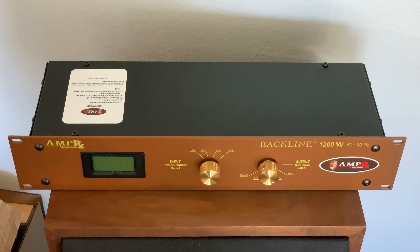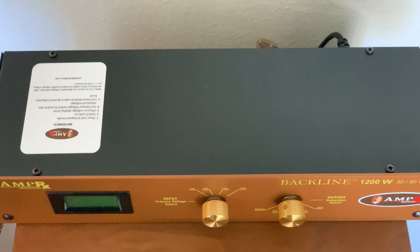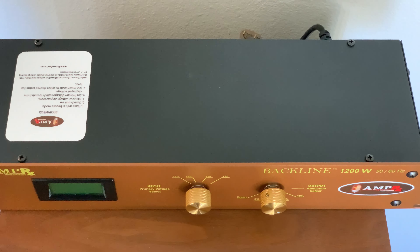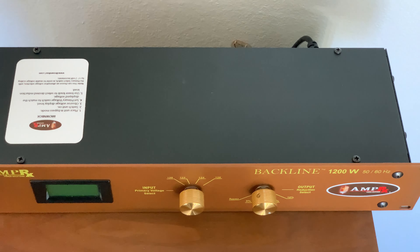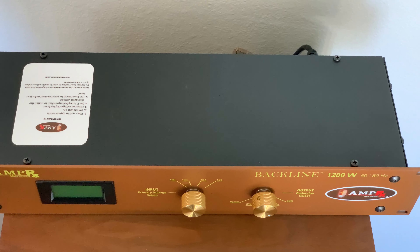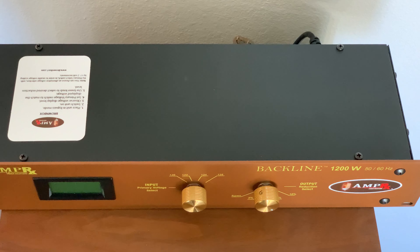The knobs are metal, it's rack mount, and it has a nice paint job and lettering. But it's kind of lazy work. It's probably built by one person who drilled the holes in the paneling and never cleaned up. It looks like it was already painted and then the holes were drilled after — so instead of drilling the holes, sanding down the burrs, and then painting, he just painted it and then drilled the holes. If you unscrew it, there are a bunch of burrs, which is just unacceptable given how much this cost.